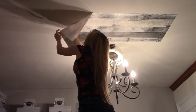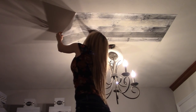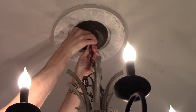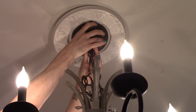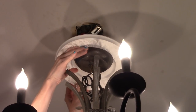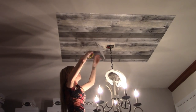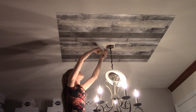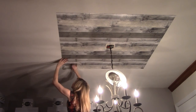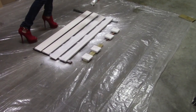With a 4-foot square, I was able to place one full piece of 20-inch wide wallpaper without having to adjust because of the light. Loosen the fixture's canopy so that you can stick the next piece of wallpaper behind it — you can either turn off the electricity to this light or be really careful not to touch any wires as you work around the fixture. Measure from one end to determine where to cut away the portion of the wallpaper so the electrical box isn't covered. Finish affixing the remaining wallpaper and smooth it out.